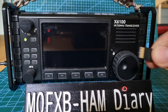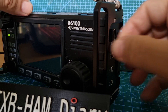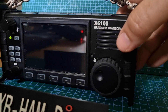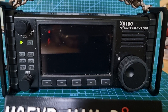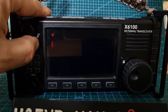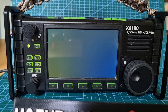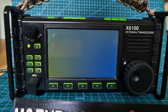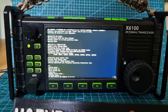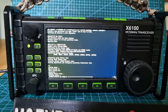Let's load it. We've got the SD card here which we're going to put in the side — version 1.1.5. It goes in quite easily, there's a little click, and it's off. Now we do have a power supply connected here, so let's turn it on with the SD card in. Hold it for a good three or four seconds, and then it will run through the process. The main one we all want is the CW decoder fix, because the 1.1.4 firmware was actually okay. You can see it doesn't take long.